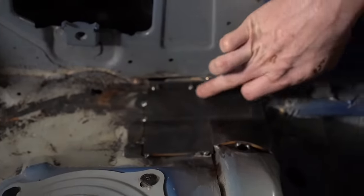When we do our door bars, everything's so tight to the chassis that when I want to weld the outsides of these door bars, I'm going to want to pull the tubes in so that I can get a good weld on that and then let them spring back. Then I will add the bracing between the main hoop.